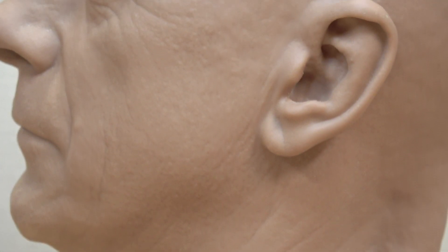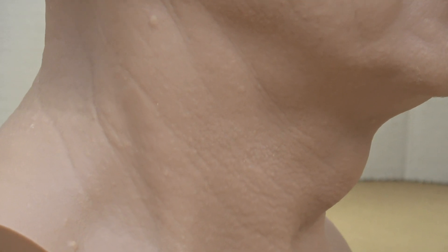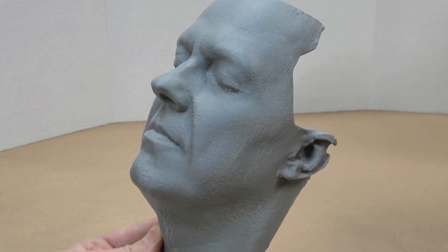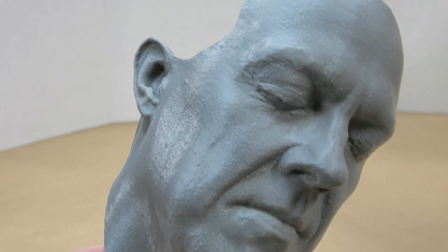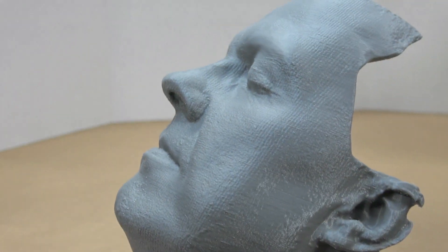Of course, with 3D scanning and printing, the result is only as good as the quality of your scanner and your printer. This resin print was made using an extremely good resin printer and very high quality scan data. A less capable printer and lower quality scan data will produce very different results, as seen here. This was printed on my FDM filament printer from a much lower quality scan. The lines in the scan are caused because the model probably moved slightly when the scan was being done — this was done with a handheld type scanner — and the resolution of the FDM print was a little lower as well. All of these things result in a printout of greatly reduced quality.